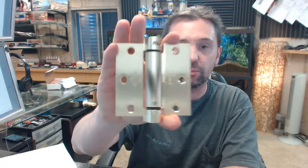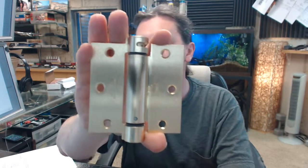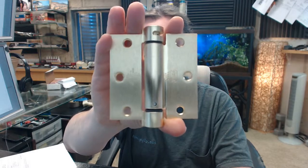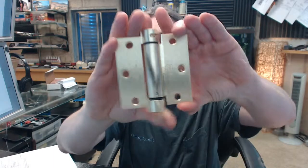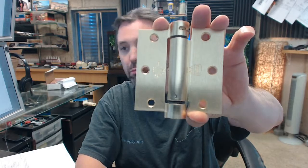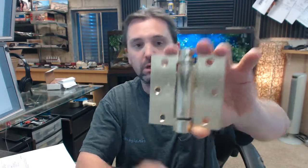Hello, my name is Rich Howard, owner of Architectural Builder Supply, and this video is to bring you a closer look at the Bommer number LB4310C-350-633. This is a 3.5 inch by 3.5 inch single acting spring hinge, full mortise, contract grade, lube bearing, steel base, satin brass plated. That's a lot. Let's dissect the part number.